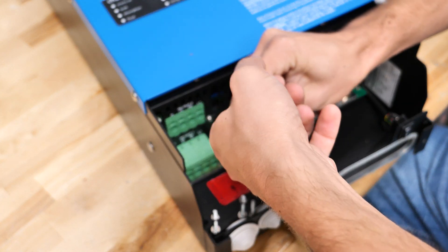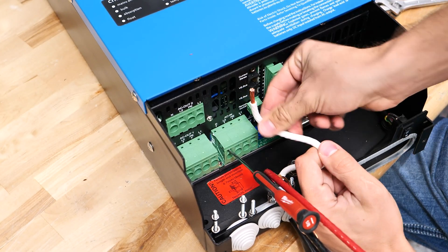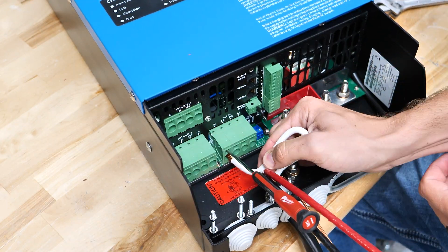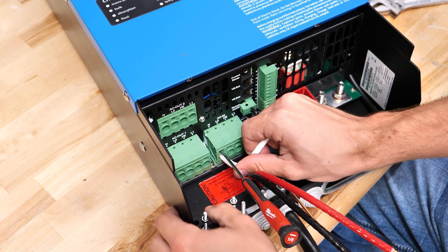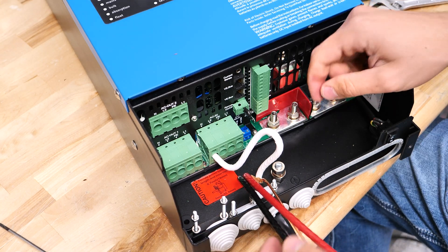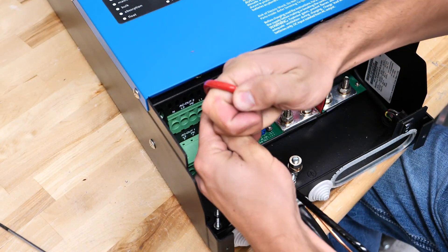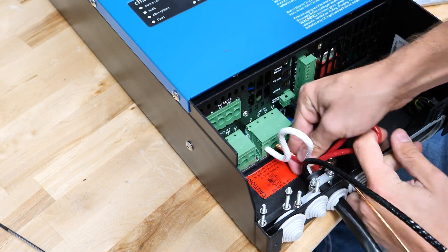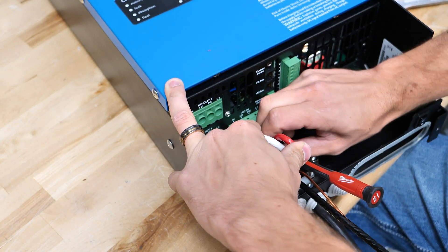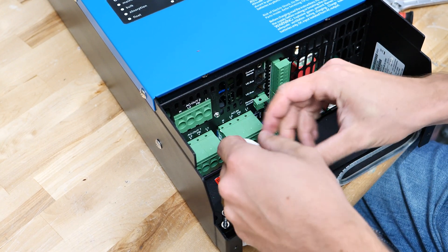So now on this wire, I'm going to make a 90 degree bend close toward the end of the wire, and then in the middle I'm going to put my finger and kind of hook it over to make a return bend. That allows me the flexibility to push the wire into the hole. Once the wire is fully seated in the bottom of the hole, you then pull out the screwdriver and do a tug test — pull on this as hard as you can and it should not come out of that hole. From there we can clean this up, bend it a little bit more, and proceed to our next wire, which is L2. Again, bending 90 degrees at the end, return bend in the middle, put the screwdriver in to release the spring, shove the wire in all the way, pull the screwdriver out, and do a tug test.